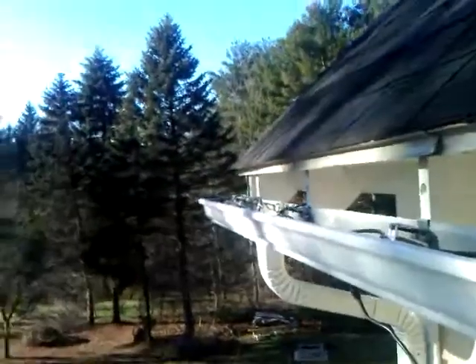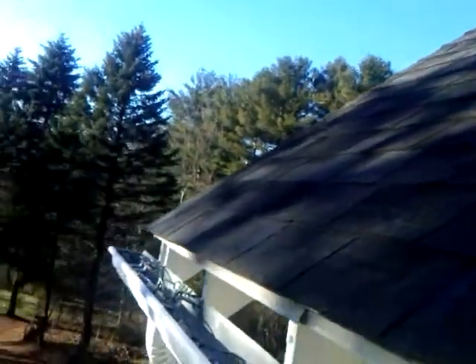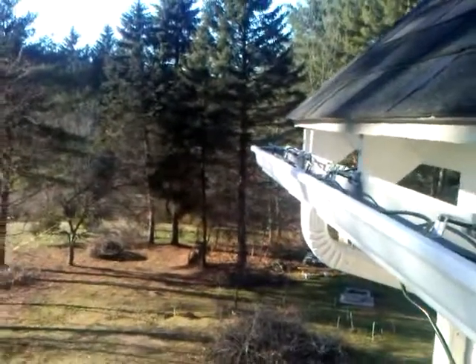On this angle I had to make sure I measured carefully because I noticed we had a sweep, a change especially towards the end. I have an overhang that sticks out beyond the roof because going down the side and top there's like a gingerbread kind of trim. I'm going to have to run another downspout to hook into that downspout — enough flow, but I don't want it dripping on the porch.